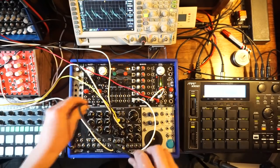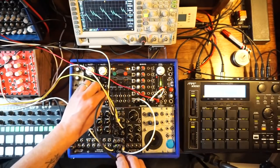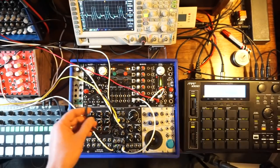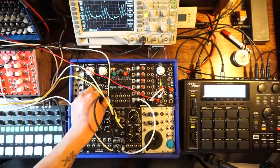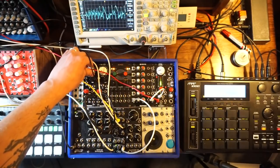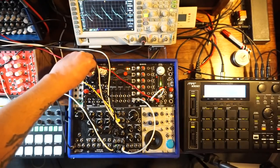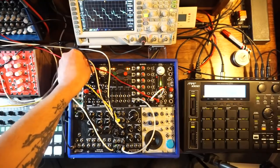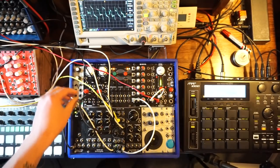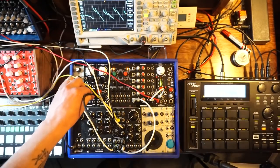And there's an FM input too, using this same second oscillator into the FM input. It's exponential FM so it's not really going to tune very well — it's more for effects and things. There's not an attenuator for that input, but you can use a Patch Pal attenuator fairly easily, or a mixer or something. You can fade in and out that FM oscillator.